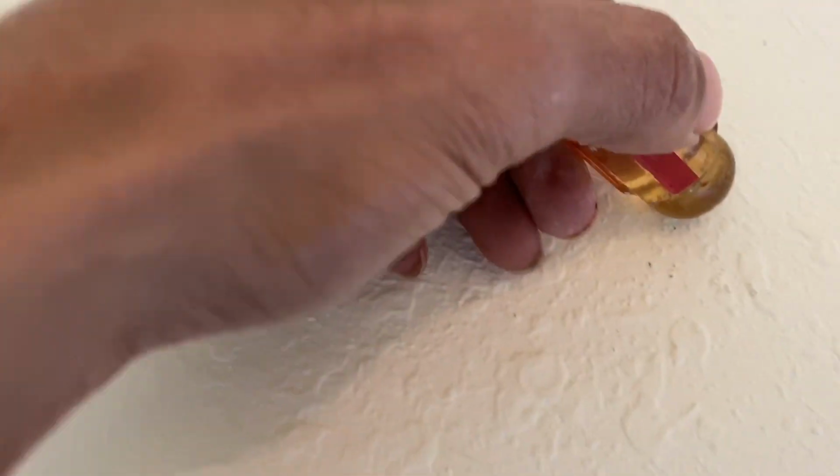So I did these two in the flat method. There's one there, and there's one there. Okay, these two, I'm gonna fill slightly differently. What I'm gonna do is depress them, and by depressing them, I mean, I'm just gonna create the slightest depression. That way the mud has somewhere to sit, or the spackle has. Just a little bit of a depression. So these will take a little bit more spackle to fill. All right, bear with me.